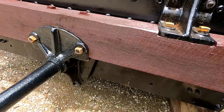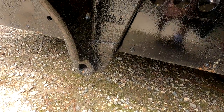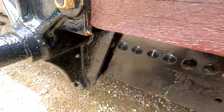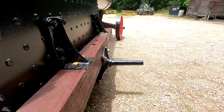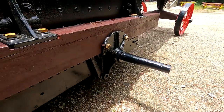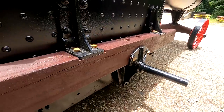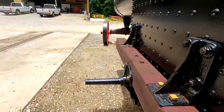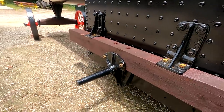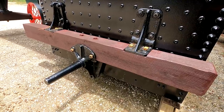What we need to work on is down here at the very bottom — we've got a hole and basically there's a rod that goes between these two. One on this side and a matching one on the other side, with a couple of nuts that tighten up and squeeze those together to hold them in. We need to build that rod to go between those two places, and that's about an inch and one-eighth diameter hole in each side.